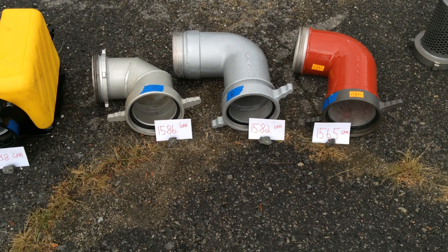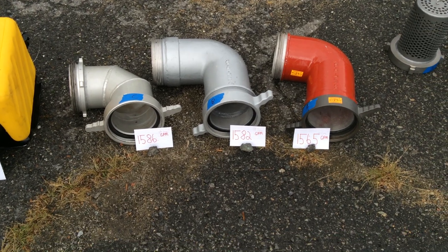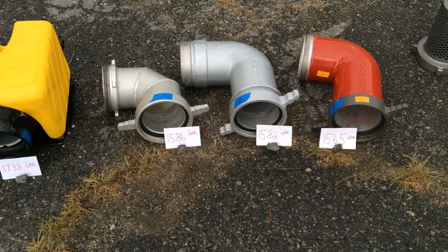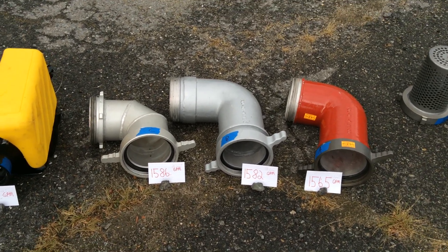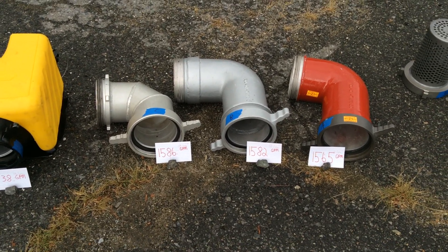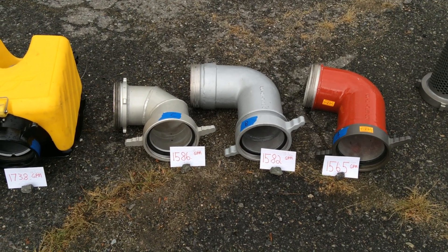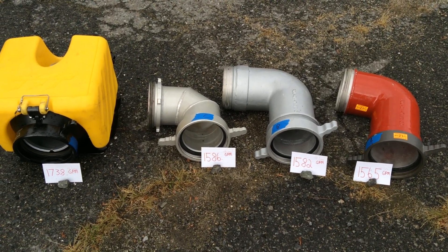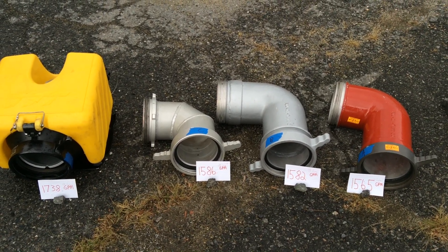So something to keep in mind — it's not a deal breaker, because if you think of the front inlet, when we did front inlet only, that was 860 gallons a minute. So we doubled the capacity of that front intake by using a suction elbow on the side of that fire truck. And if you think about how many of these are set up nowadays to use the single lane tank concept — the through-the-wall drafting of your dump tank — that certainly is good reason to have an elbow if you operate as such and don't use the front intake. We really cannot stress enough to not use that front intake as your lone suction port if you expect to flow high volume water with your pump.